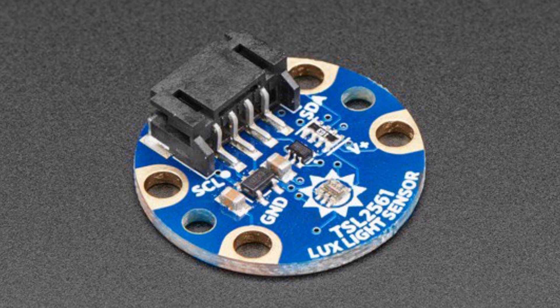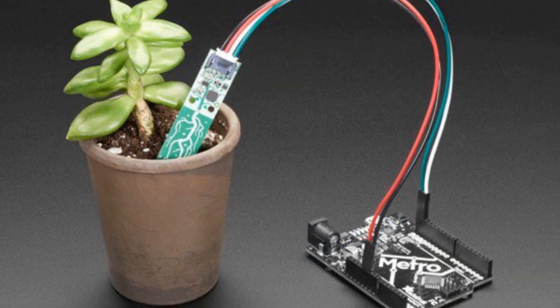You can see it's got a round shape, and we were thinking you'd have alligator clips to connect to stuff. We thought we were going to be doing more wearable stuff. Turns out we didn't do as much wearables as we thought, so we don't use those alligator clips anymore. The soil sensor is an example of a Stemma connector on an I2C device. You can just plug it right into your Metro or what have you, and it communicates over I2C.